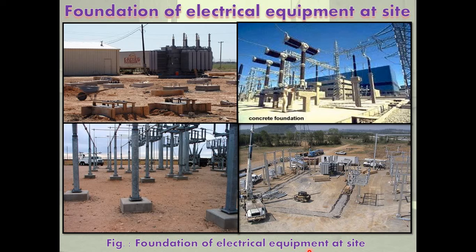If the height of the foundation is less and the surrounding land is elevated, the temperature of the surroundings increases, so the oil level increases as the oil becomes hot. Thus the oil level increases, so the foundation level of such electrical machines is relatively high. In the case of CT, PT, transformer, or circuit breaker, a safe distance from the ground should be kept to prevent flashover in the rainy season. For rotating machines coupled to a turbine, the minimum distance of 150 mm is kept between the rotating part and the ground.